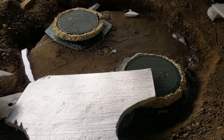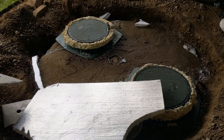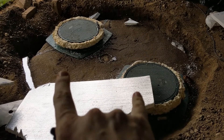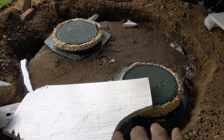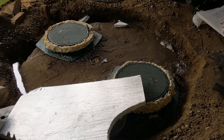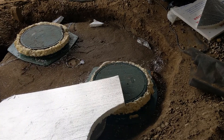I'm waiting for the surface to dry off before installing — I had to clean it and spray it because I did some repair work on some cracks that were shoddily repaired previously. You can see the two different risers here: the two-inch riser on the left and the three-inch riser on the right. The ground is a little higher on the right and lower on the left. The goal is to keep them hidden under the rocks while still being easily accessible.